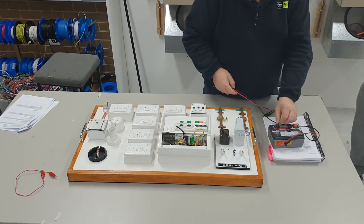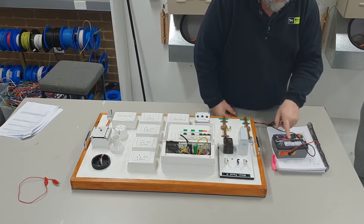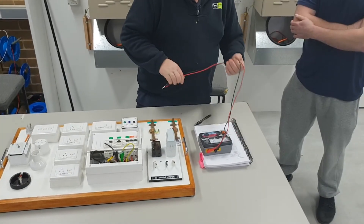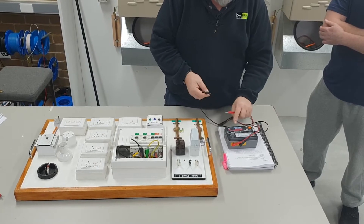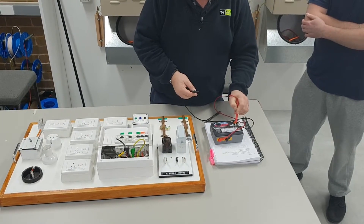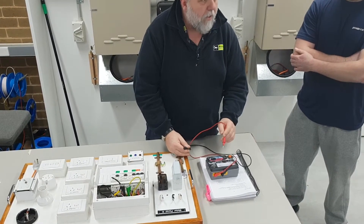First, make sure the batteries are working - we check that we've got full power. If the needle is sitting right down toward the end of B for batteries, replace them. You want a good strong output. We have two blue scales: zero to three and zero to 500 ohms. If it deflects above three, we take it up to 500.